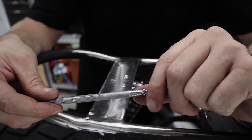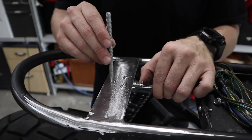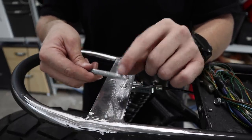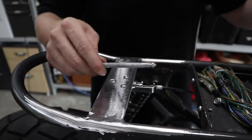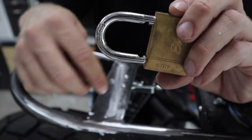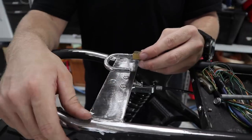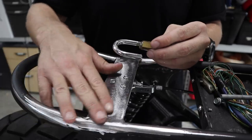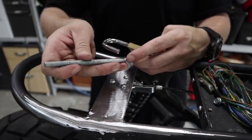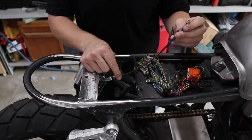I got an old bolt and had a go at making my own post just to see how it would go. As you can see, it latches — but on the release, because it's rounded, it keeps catching on that hole and it would probably drive me nuts. So instead of making it completely round, I'll do what you see on a padlock — pretty much only a notch on one side — which I think will be a lot easier to go in the hole, latch, and then release without catching. Not everything works first time round — sometimes you have to learn the hard way. This was just a test to see how much it would stick out and whether it would actually push that little mechanism out of the way.